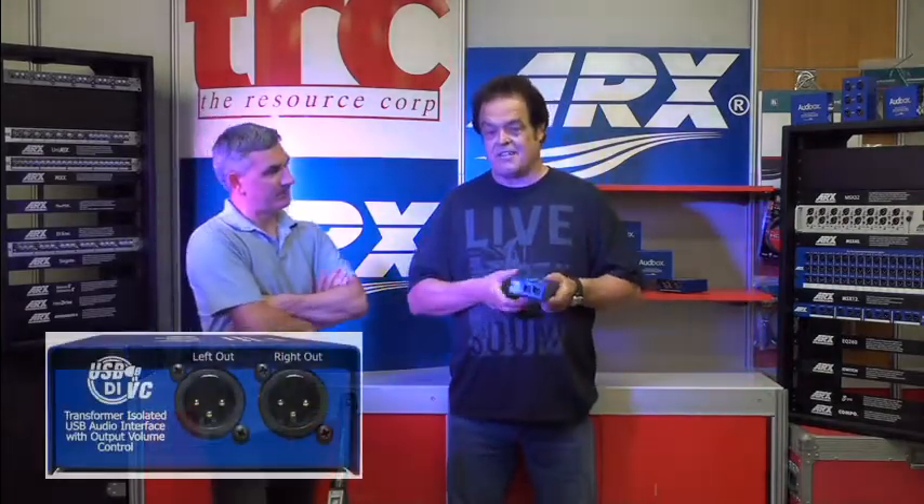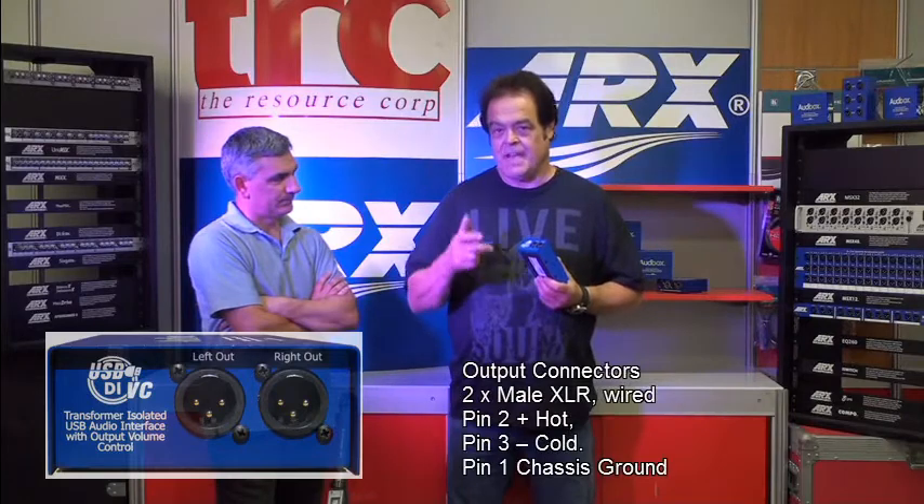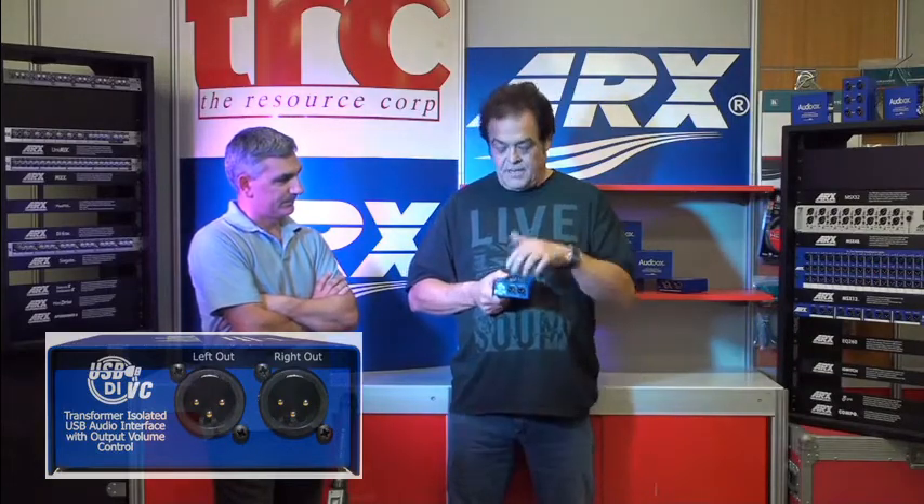By pressing that, it lifts it out. With XLRs — why go XLR as opposed to RCA? An XLR is the industry standard connector. This is an output and the female is the input. This will match up with the inputs on your mixer, and it's a balanced connector. It means it has a hot and cold, positive and negative, and a separate ground. This is a transformer-balanced unit. Inside here are two high-quality audio transformers. This will give you clean sound and total isolation from ground noise. In major systems where you have big splitters, they're often totally isolated with transformer — it's called galvanic isolation — meaning none of the noise from somewhere else is transmitted through that connection. So this is the way to go for true professionals, and it gives you professional results.